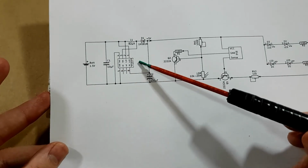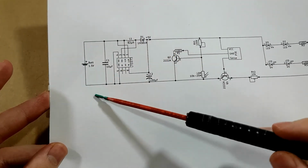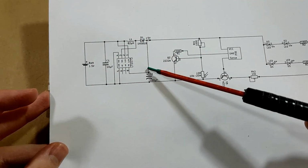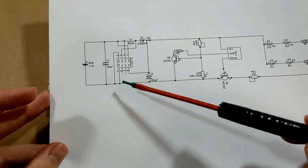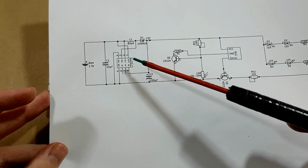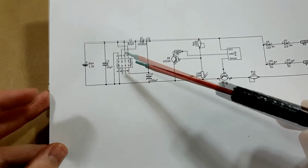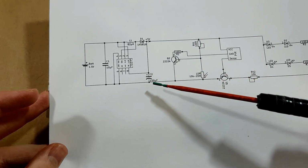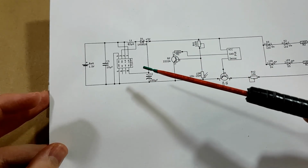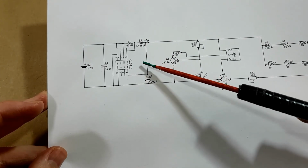I have been having some difficulty running these LEDs off of this circuit, but I've determined that the majority of the issue that I'm having is the breadboard that I'm using for it. The connections are very poor, so what's happening is small fluctuations or anything bumping it is causing the power delivery to cut out, and that's causing the LEDs to run really low. I'm planning on putting those into a proper perf board eventually here, and that should make a huge difference.